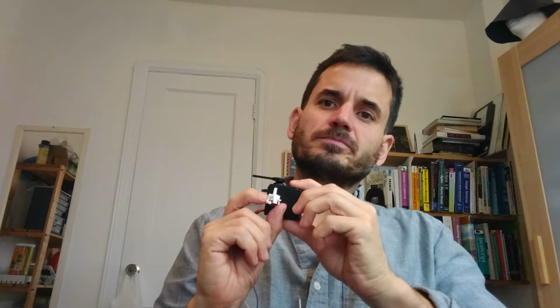All right, let's look now at an example of this modified RC servo in action. If you're just seeing this for the first time, we've modified this RC servo so that it can continuously rotate while still maintaining its ability to track position. And we did that by replacing the potentiometer in here with one of these Mocoders, which is a magnetic encoder. It goes right there.